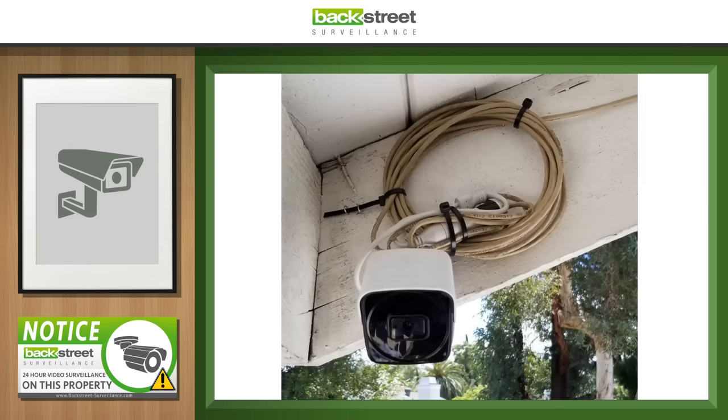This is a new camera installed with very old cabling. Some people would call what they did a service loop — I'd call it lazy. They used a pre-made cable and pulled from the video recorder to the camera location, which left all the excess cable exposed to weather right next to the camera, lassoed up with tie wraps. They should have pulled from the camera and left excess in the attic space, crawl spaces, or somewhere out of the way — not exposed at the camera. They did use a watertight connection, but as a whole I've got to give this an F.